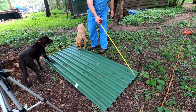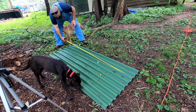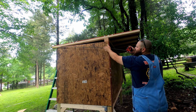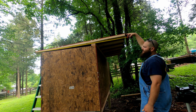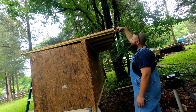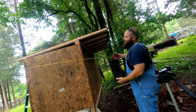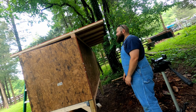Alright, so this is something I do all the time and it messes me up. These roofing panels are 79 inches long. We measured the 2x4s to be 79 inches long, and I was like, I'll just cut the plywood a little long, because longer's better. But now I'm thinking, no, it's not better, because now there's going to be bare wood, and the roofing's not going to be touching. So now I have to take the circular saw up there and rip down the entire thing.